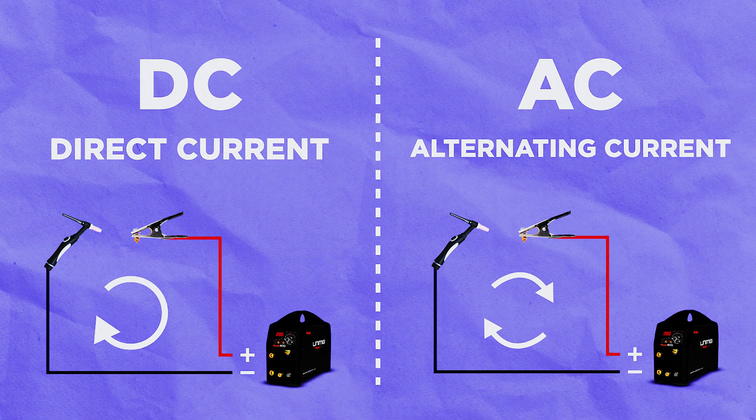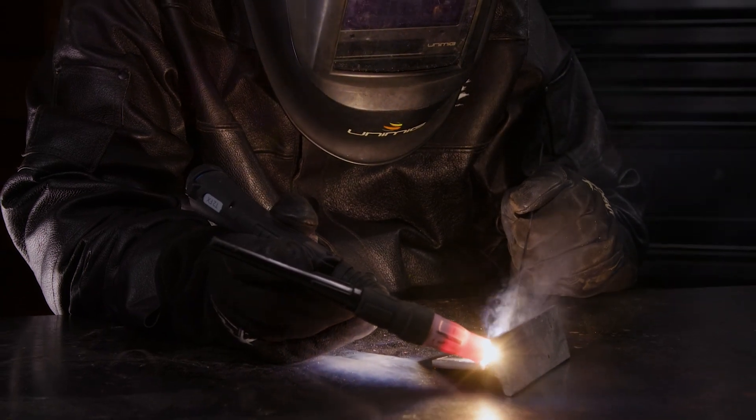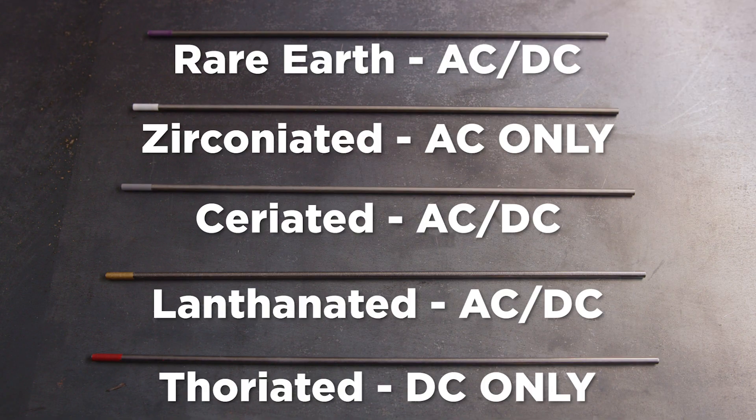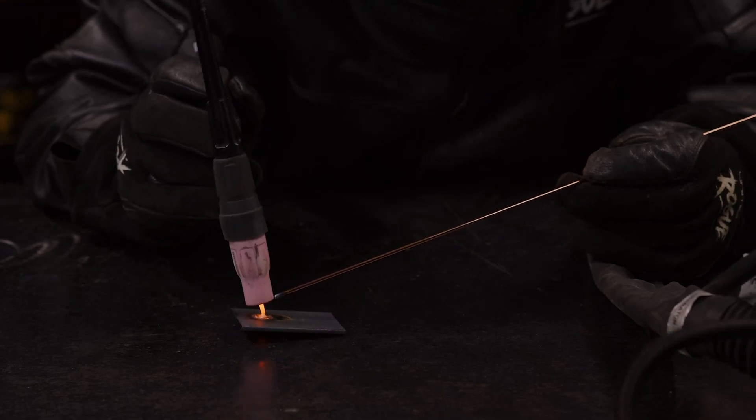How well does a tungsten work when used on alternating current? AC welding is only used when welding aluminium or magnesium alloys, as you can't use DC for them. AC means the current flows both ways — a cycle is completed when it has flowed one way and then back the other. This back and forth has different effects on tungstens than DC does, and some tungstens are better suited for AC applications. What happens if you use a thoriated or any other DC-specific electrode on AC? You ruin the tungsten. When the button is pressed for high frequency, the tungsten fizzles and burns up back into the cup and there's no saving it. If you need to weld aluminium, zirconiated tungstens are the best.